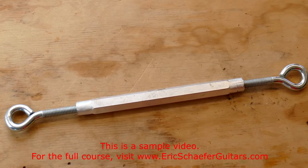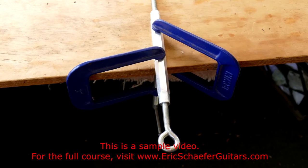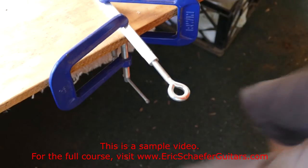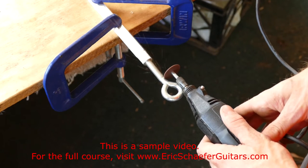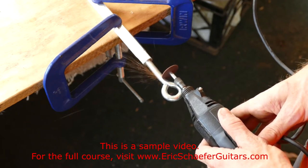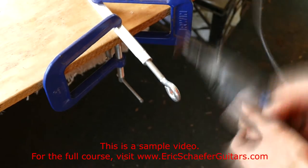Okay, so moving on from that, now we have our turnbuckle. This is a regular hardware store variety turnbuckle, and I've clamped it to my workbench because I'm going to cut the eye of the turnbuckle, or that little circle doohickey on the end. I'm going to cut that off with an abrasive wheel and a Dremel tool. Of course, you could also use a hacksaw to do this.